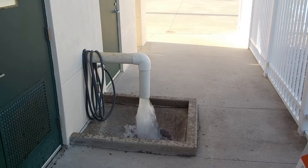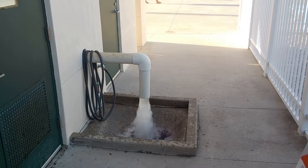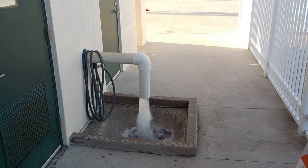This particular one is not going to be as bad because our dive well is not as heavily used as our main pool, but we're going to do the next video with the main pool backwash and then you'll see what I'm talking about. We typically run it about two to five minutes depending on how dirty it is. You basically watch the water. In a dive well you don't need to stop the pumps to backwash — in the main pool you absolutely do, in most setups for the big pool.